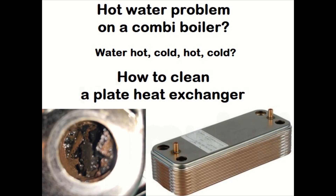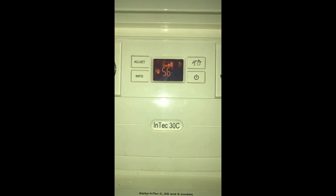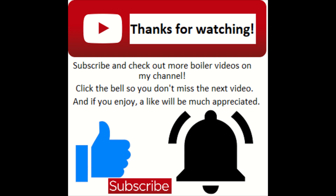If there are no drips, happy days — continue to check for a few minutes to make sure you haven't got any weeping. Open the hot tap to get rid of any air and flush it out a little further. Begin to fill and re-pressurize the boiler without the power on. Make sure the air vent works — if you can't hear that hissing, open the pump nut and bleed the pump so it doesn't burn out. Then we can test: turn the boiler on, open the hot tap, and you can see the temperature is rising much, much slower, and it now modulates. Success — we've cracked this hot water problem on this particular boiler.